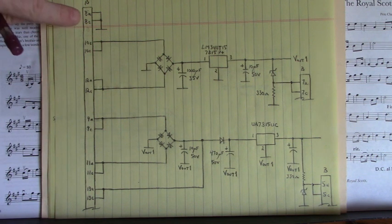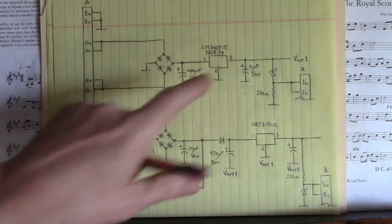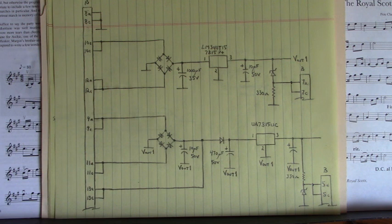Up here, now you'll see this ground everywhere. I had it on 8A and 8C. That's this ground right here. And also, I think 24A and 24C. I might be wrong. We'll get there in a minute. And 25A and 26C maybe. But this ground is all over that small connector labeled B on the power board. Let's go to the next page.